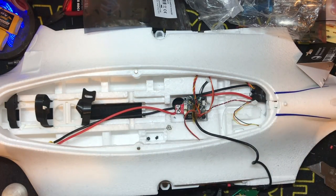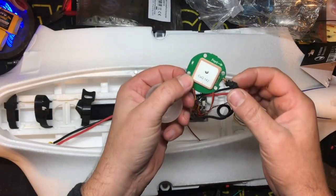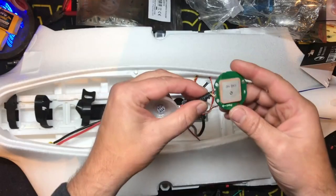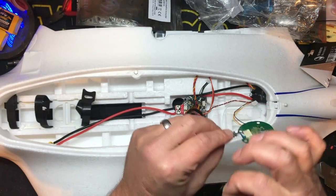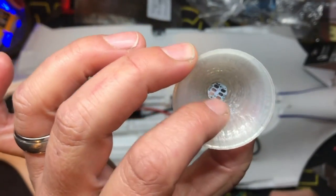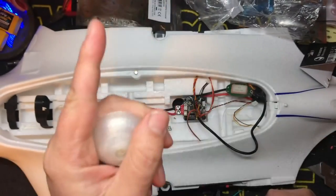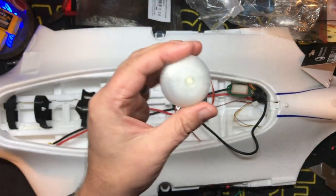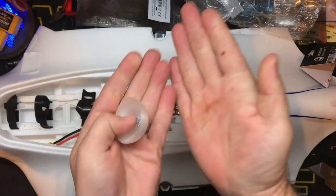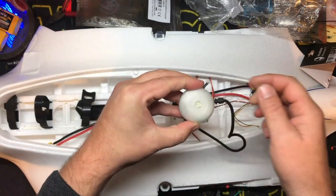After that, we're going to mount the GPS. For the GPS, I 3D printed a cover because I lost my cover in a crash a long time ago. Orientation should not matter because orientation is usually only relevant if you're worrying about having a magnetometer or a compass. I also put in an LED in the top because we're going to program our iNav — when it's flashing red, no satellites; flashing blue, acquiring satellites; flashing green, 3D satellite lock, and then we can take off.